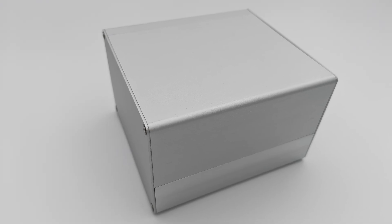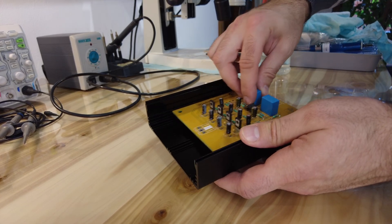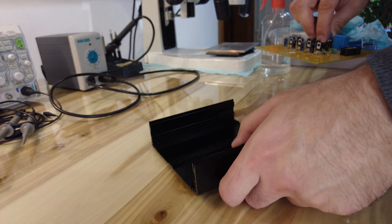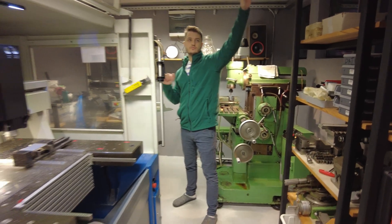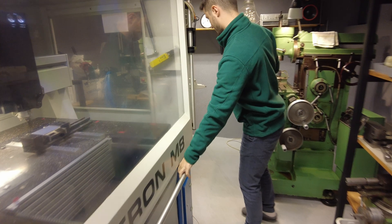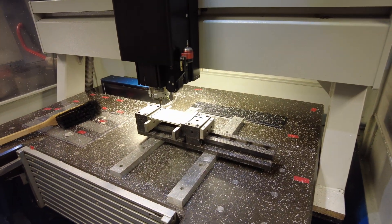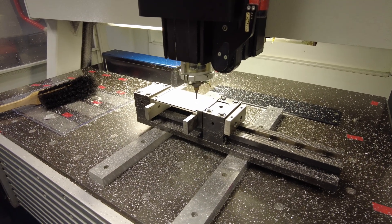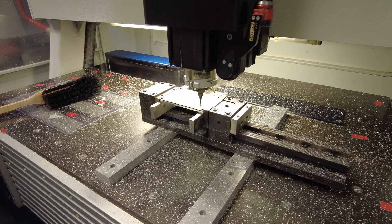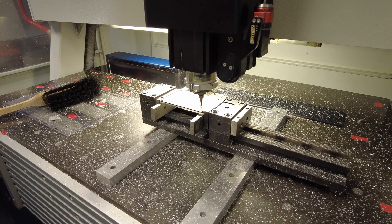For the enclosure, we bought these already-made and anodized aluminum enclosures where the PCB just slides in. You have to make sure your PCB is of compatible dimensions, and then afterwards we had to mill holes for our connectors. I really like these already-made PCB enclosures — they only cost a couple of dollars, roughly around $5, and they're made out of aluminum, so they're perfect for these types of projects. We got ours at GLC's website. Since we already have a CNC machine, we decided to use it for maximum accuracy.